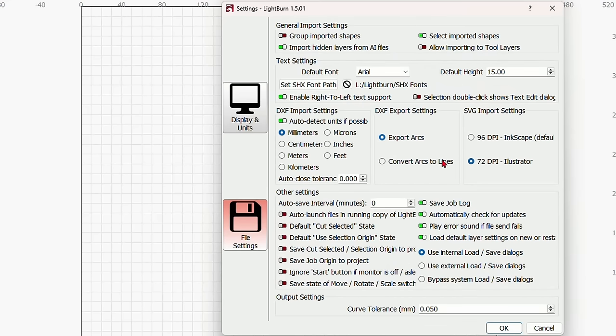So we finished the engraving on this one, and we're now to the cut section. When this cut is finished, I will go and position the other wood exactly as it was before. If you remember earlier, we had it way up here. So I'm going to leave this in that position right there, and we're going to actually cut it out from down here because we're in current position. We're using current position. Wherever the laser module is at the time, that is the current position, and that is where it will start.